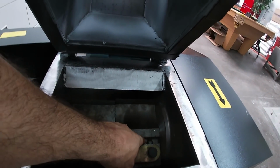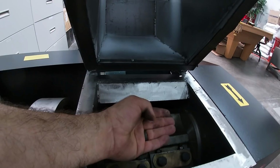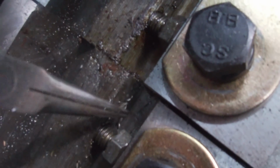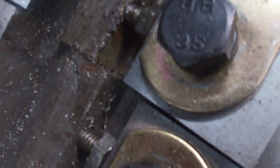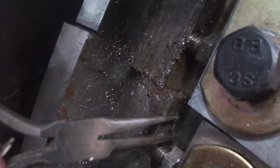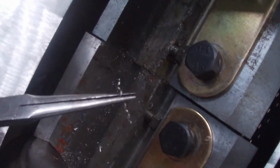So it's a little tricky. That's machining shavings, like thread. Yeah, those are threads from where they tapped the holes, so they didn't clean that out. So the people who actually machined these parts threaded or tapped these holes, but didn't even remove the actual threaded curlicues from the tapping operation. They just drove the bolt in on top of it and kind of broke it off. See, that one is still embedded in the threaded hole with a bolt on it. So that's from gun tapping that threaded hole. They just left everything in there, all the machining chips.